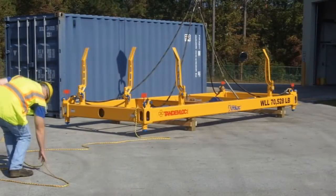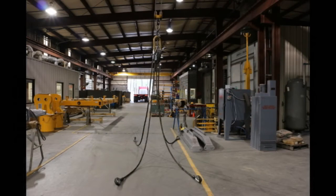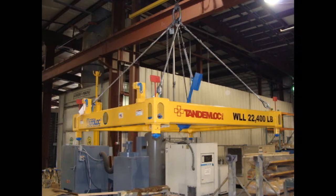Let's go over the different parts of the spreader and learn what the components do. The two major components are the wire rope sling and the frame. The wire rope sling connects to the four corners of the frame and has a single hook point for the crane. The frame is designed to absorb the compressive forces imparted by the sling due to the angular loading at each corner. Loaded containers, when lifted from the top, must be lifted using a container spreader frame, otherwise the container could sag and collapse.